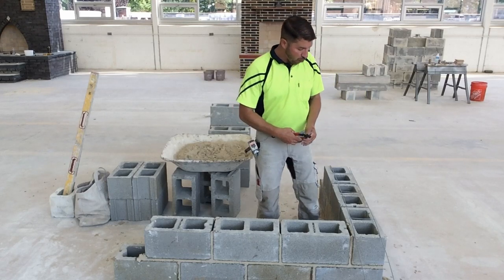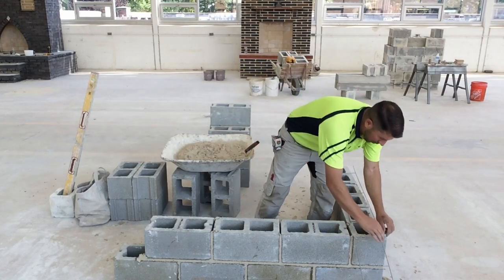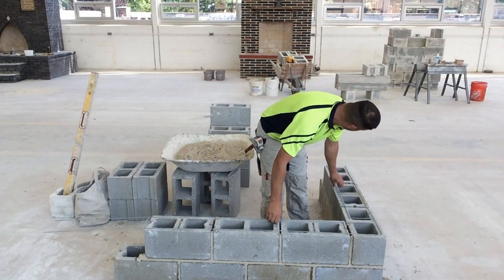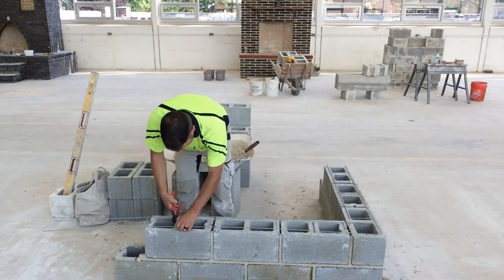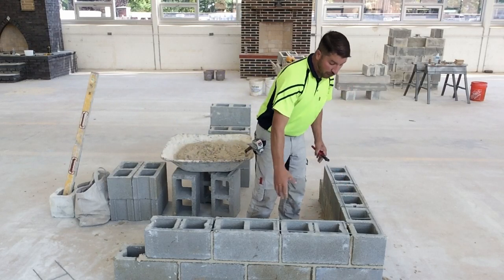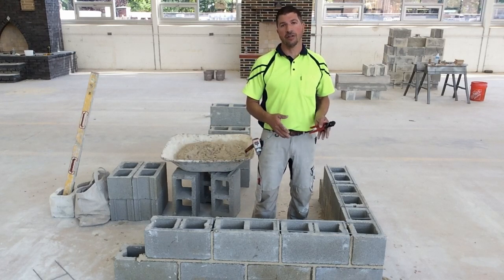What we do is lay the wire on top of the corner, and we're going to cut in a couple spots and put a bend in the wire right where the corner is, basically making corner wire. You can buy it, it's more expensive, but it's not needed. Now we just cut it to length. And we have one continuous piece of wire in the corner with the rungs of the ladder, we'll say, right where the cross webs are. That's a little advanced. We're not using any wire in this project.